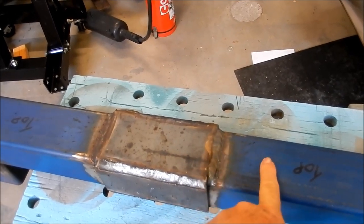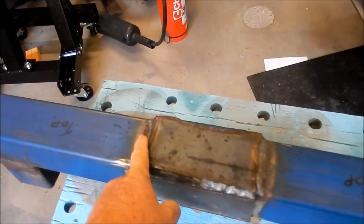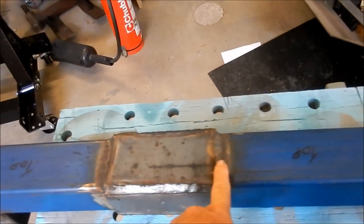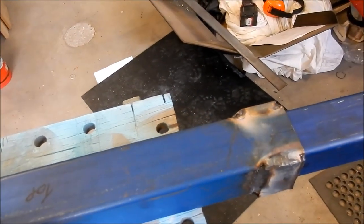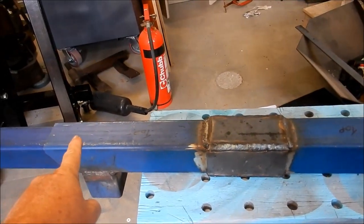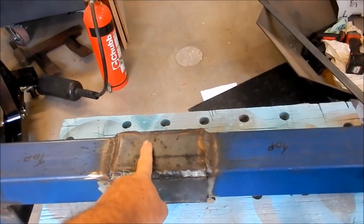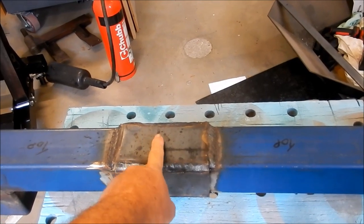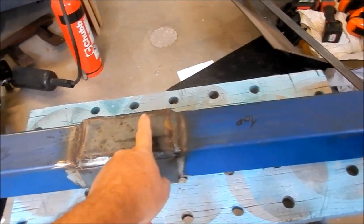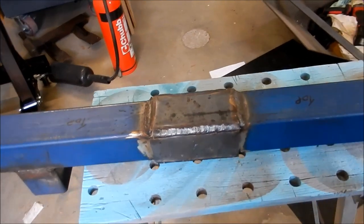I had to be very careful balancing the welding sequence and had to do some welds across the tension component of the member, which I don't like doing. You've got to be very careful not to undercut and weaken it, but that was the only way to get the bow to come back. I probably stuffed up my sequencing a little bit, but it's pulled back quite nicely and it's very, very straight now. I need to put the truss cord on and the support post in the middle - I'm going to put the truss cord under a little bit of tension to help support the SHS further.